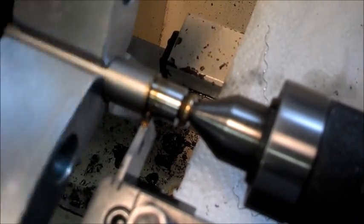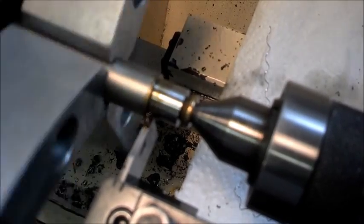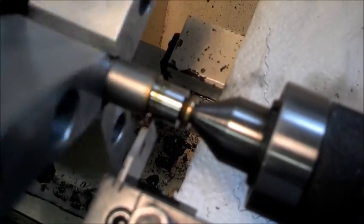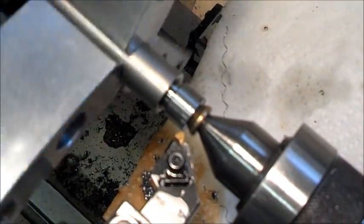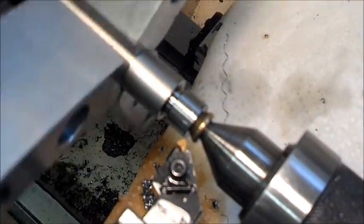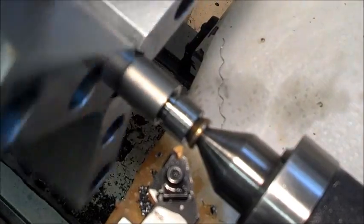There's the relief cut. You can see it — I'm just cutting the back corner. I'll zero my lathe out and then cut it to a little bit beyond my thread depth. Here the threads are being cut with a relief cut, so I'll finish cutting them and then show you.